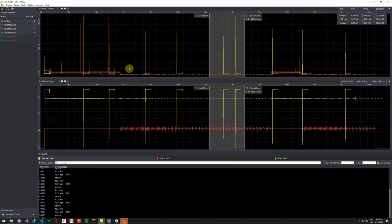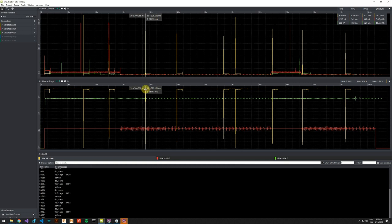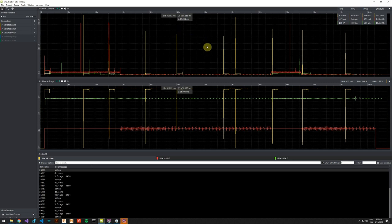We can basically have a look at where our problem starts. No surprise, the voltage drops happen where our transmissions happen, where we have a high spike. To use coin cell batteries, you have to take a different approach, where you might have to make some kind of a buffer with a capacitor or something like that. Your code also needs to try to respect pulsing so that you don't make the device do its work as quickly as possible. You might have to insert pauses to let the battery regain its voltage.